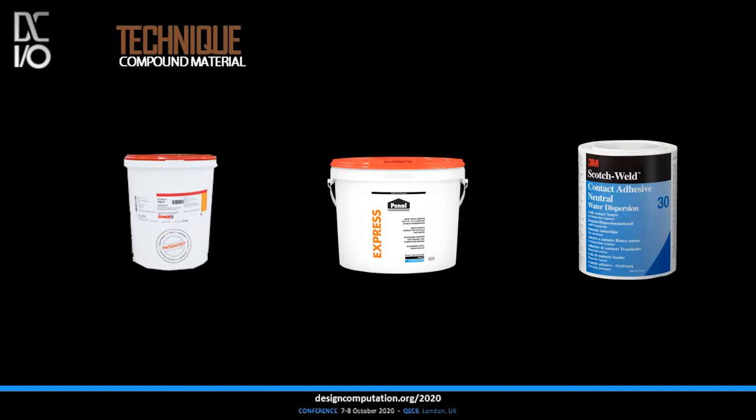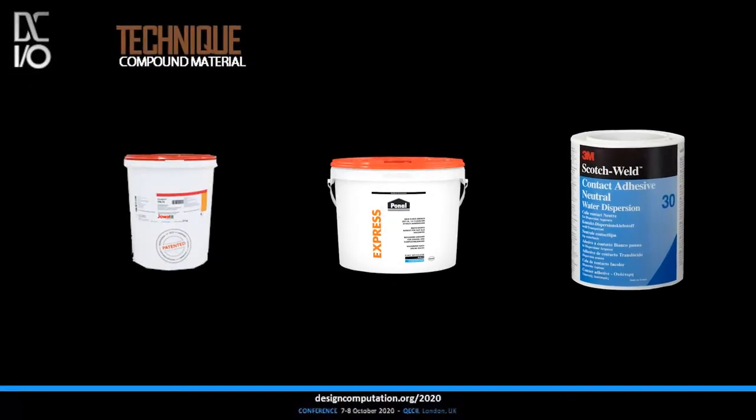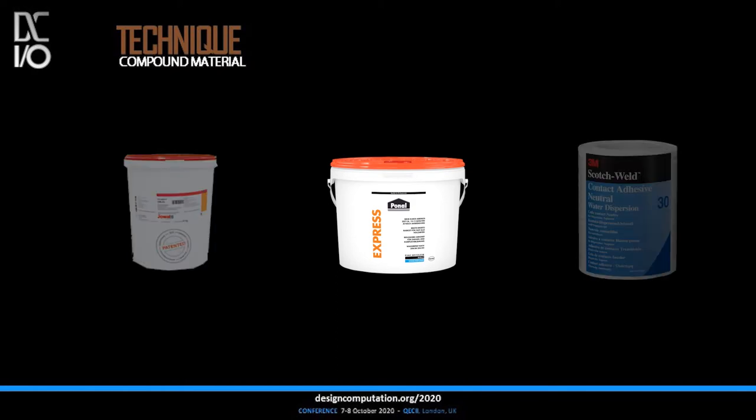For combining the filament strings in a fast additive manufacturing process, an adhesive system had to be chosen. Our method requires a fast drying and binding time at an affordable price. As the material itself can be manufactured inexpensively, suitable adhesives should be equivalently economic. Several adhesives such as white glues, UV resins, and contact adhesives were tested. Fast white glue, which is suitable for binding wood very well, is not fast enough for this purpose and cannot be adequately accelerated.